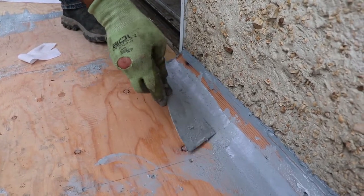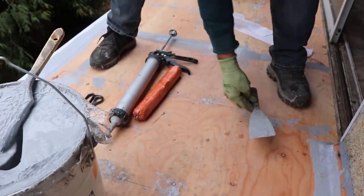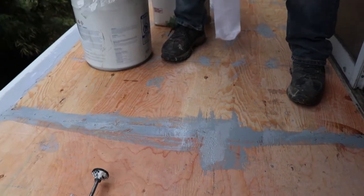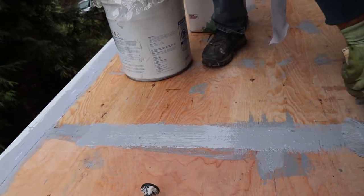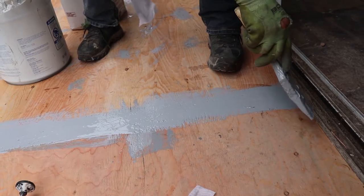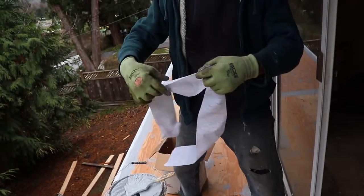To fill in the big holes, I mix some sand with the base coat so I can fill in the big holes. For the joint of the plywood, I left this last joint here for you guys to see. I have the caulking there filling the joint, then I just go with the base coat — a little thick but it works. Just want to do the four inches. This part here I'm not worried about close to the door because we're gonna replace the door when the time comes.